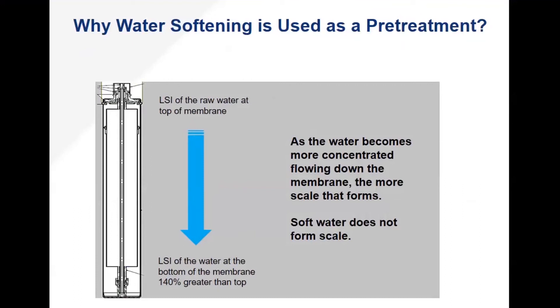If you're dealing with residential drinking water with extremely high TDS, understand that your drinking water RO system is going to be affected, and a pump may be required. Or you may want to feed that membrane soft water to give it a better lifespan. If you want some minerals back, either install a blend valve around that RO or install a small calcite feeder after the RO for remineralization and taste. And understand: when we're removing water from the raw water and concentrating the waste, we're concentrating those minerals — which is why we need to inspect drain lines on high-efficiency RO systems so they're not scaling up as well.